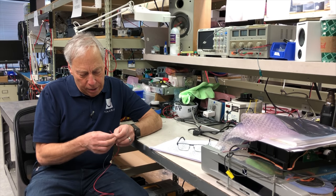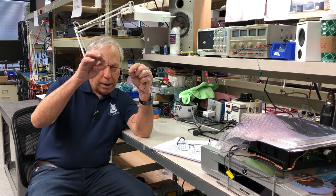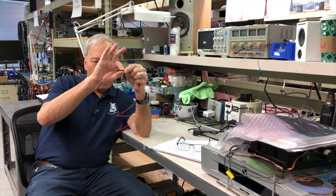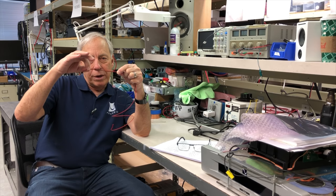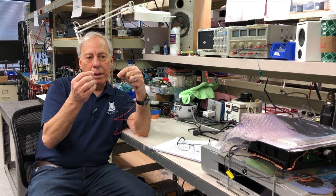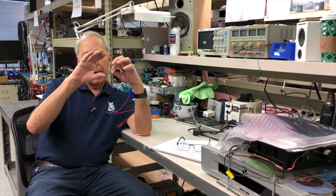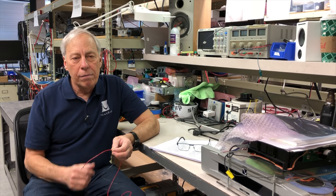Anyway, here we are, what were we talking about? Inductance. If I take two pieces of wire and I put them real close together, and current passes down here, it generates a magnetic field. And anytime current passes down a wire, it generates a magnetic field. And if another one's in close proximity, we get what's called inductance. An inductance is like an inductor with a coil of wire, and that inductance is going to roll off the top end